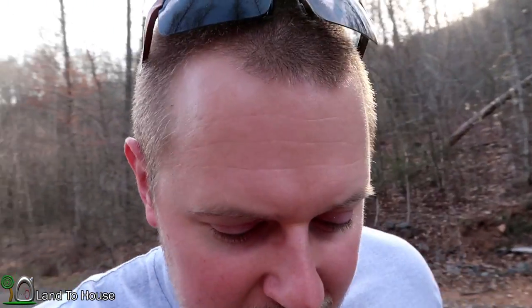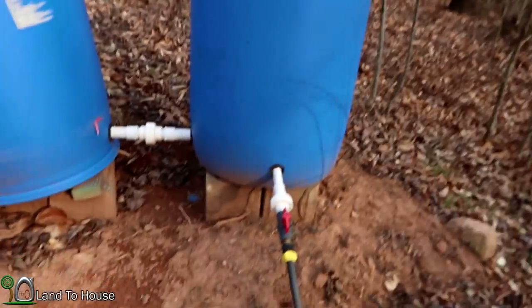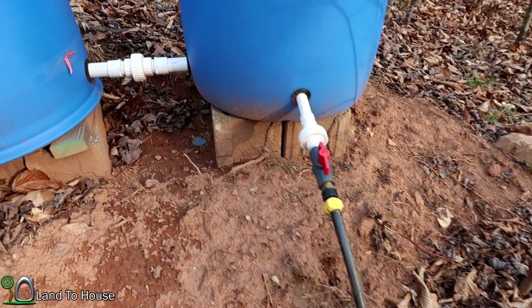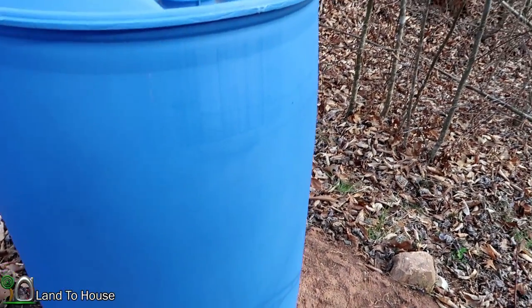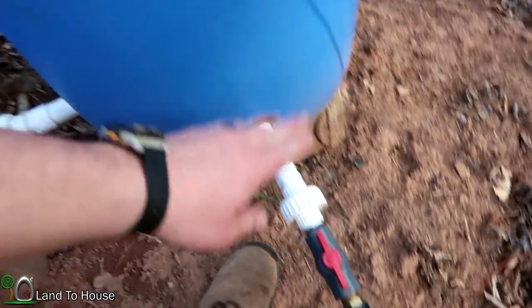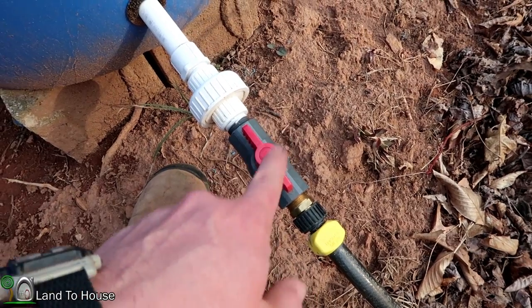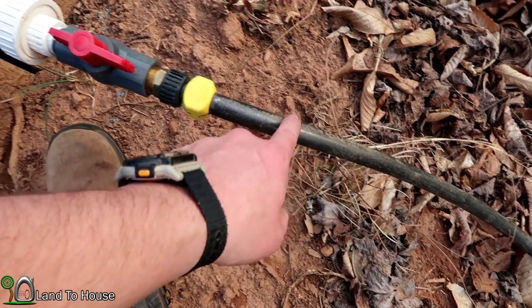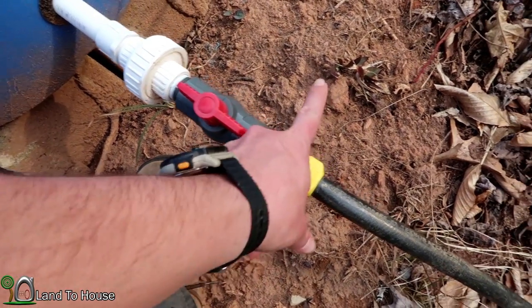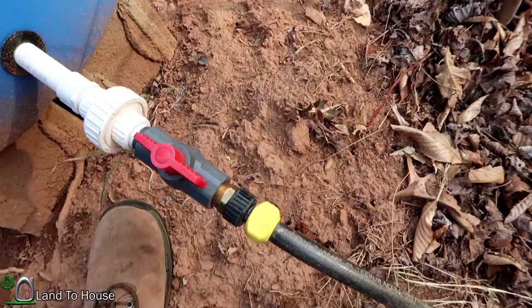I worked legs at the gym yesterday and I am sore — this hill is kicking me pretty good. So my long time friend and subscriber Mike Collinson has a ram pump set up, and his storage tanks have the inlet and the outlet at the same place. For instance, I'm filling the tanks right now through the bottom of the tank. Since atmospheric pressure is the same no matter how big the water diameter is, it'll lift. I'm thinking about using his design for my storage tanks when I actually decide to get them permanently installed — a garden hose or pipe will come up to a tee and fill from the bottom, then tee off to wherever I want my water to go.